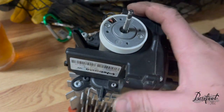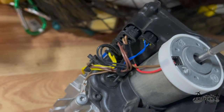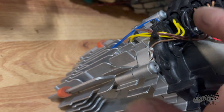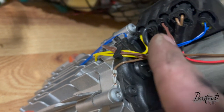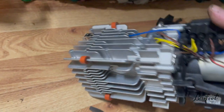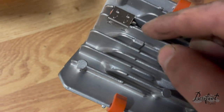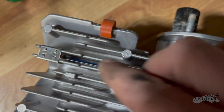Next we're going to pull this electrical unit off. It gives us many wires, so let's look at the back here. We have blue and blue, brown and brown — they really color-coded things to screw this up. Blues go up here, browns go here, blacks below them, and yellows below those. So yellows, blacks, browns, four-pin, blues. And then this little dude gets creative — some kind of case temperature sensor. Let's zoom in on that so we can see how it goes.